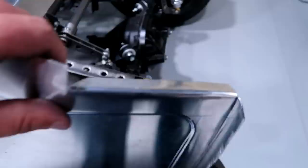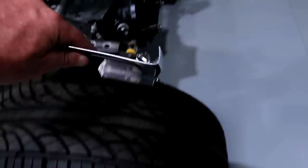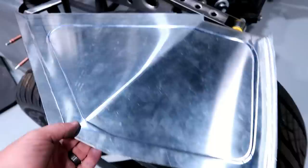And then this is what I did with that tipping die. So you can see that it has a roundness to it, but it's bent. And that's gonna go right in here at the quarter window. So that's why it had to be round. And then that flange there is what attaches right down in here. Basically, goes in there just like that.